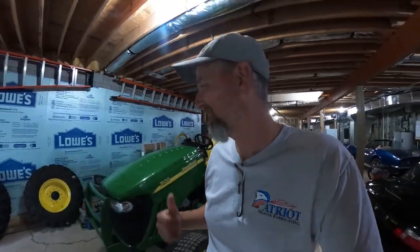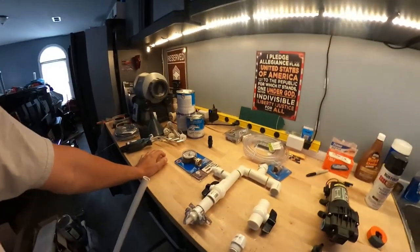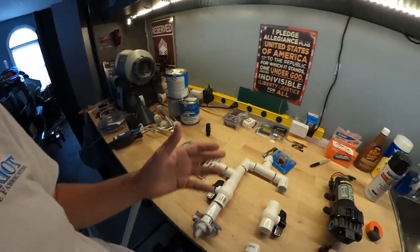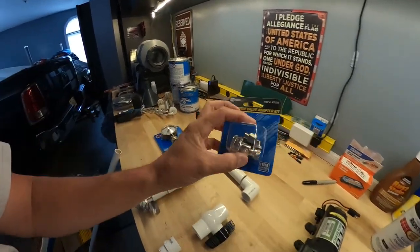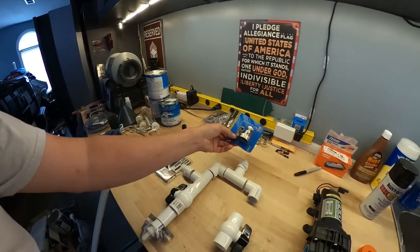Let's get the tractor done first. All right, so to put the fluid into the tire, you gotta have a manifold that you gotta kind of build. And I didn't come up with this. There's a lot of different ideas on the internet, but there's a lot of stuff similar to this. This is what I found at my Lowe's, but there's a three-piece tire adapter that basically goes up onto the air stem of the tractor, right?